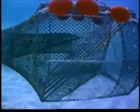The National Marine Fisheries Service has developed a trawling efficiency device called TED that significantly increases a fisherman's trawling time. Originally designed to exclude sea turtles, the TED also excludes jelly balls, sharks, skates, rays, horseshoe crabs, and loggerhead sponge from the catch. The TED device uses slanted bars to guide unwanted catch through a top-opening door.